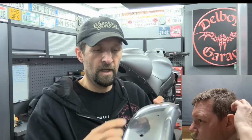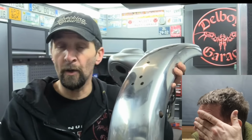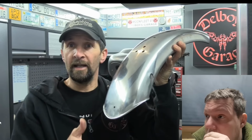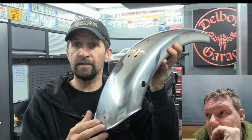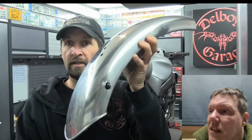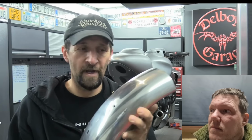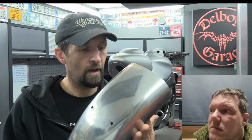That will stay with it, but I've got to section it like I did the front one. What do you mean like the front one? Why did you chop it in half? Cut a V in it, weld it all the way down so it's a little bit more of the same, and then I can put that on the back end. Back end, I want it to come quite low to protect the new radiator and the belly pan that I put in place and all that, so I can always cut it up if it's too long. So I'm going to make the rear section, this bit, as long as I can, and then I can trim up the front half as much as I need to. Right, it's enough chat, let's get stuck in.